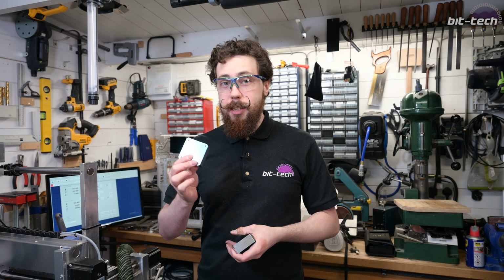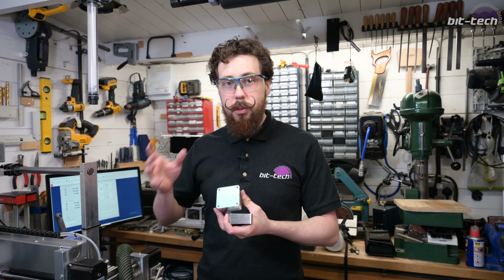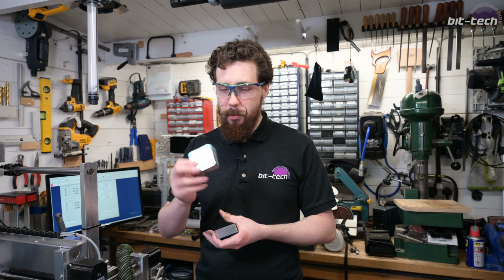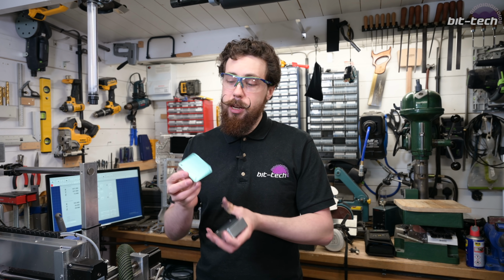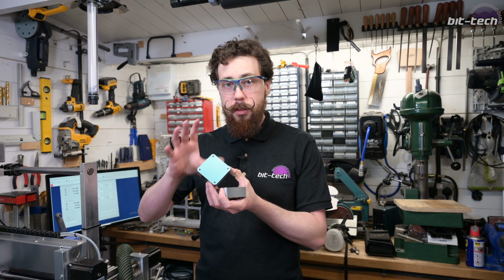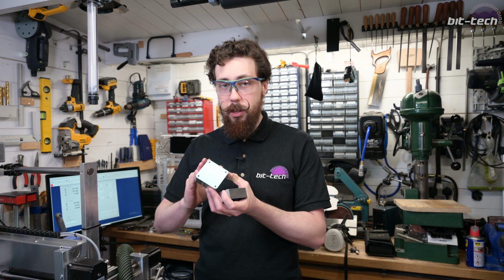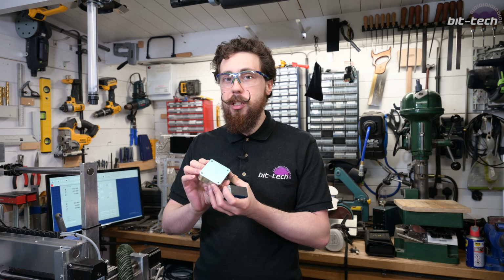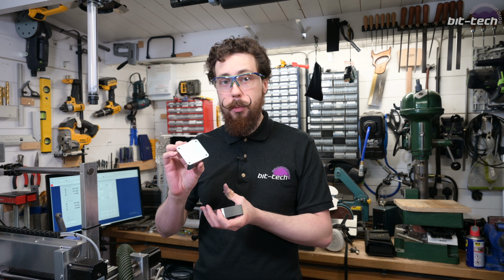Now, that's actually quite an easy thing to do on a beefier machine, but because I can only step down 0.5 millimeters at a time, that's going to take a really quite a long time, because these are almost entirely hollow. So we're going to have to play it careful, and I've got some rather long end mills for the corners as well, so I'm going to have to use the 4 millimeter one to get right in there. But it should just about manage, so fingers crossed that will all work out.